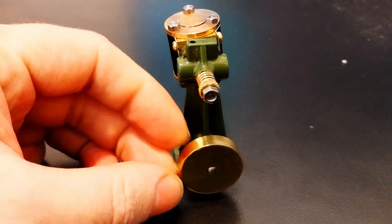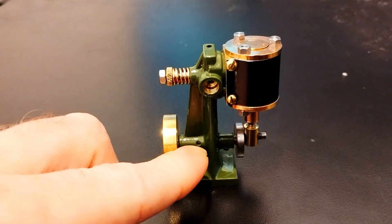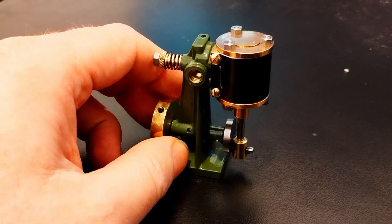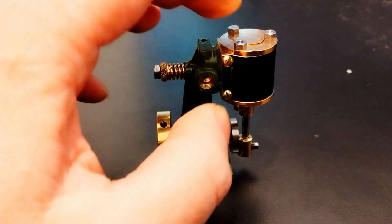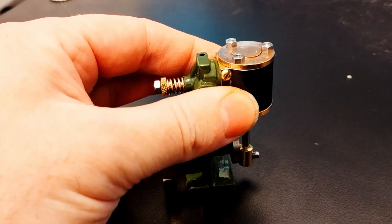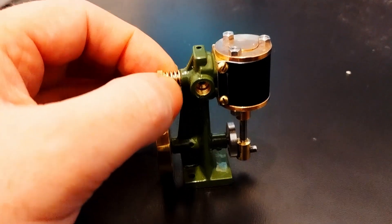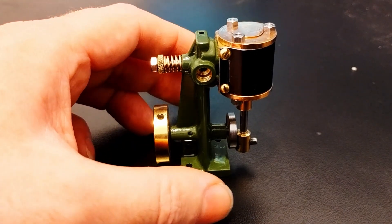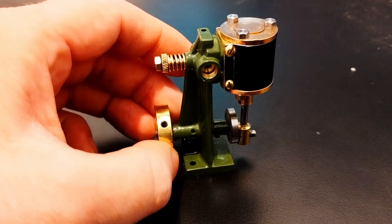The engine is now finished. I drilled the oil port here to enable the crankshaft to be oiled. This nut here I originally did up tight while the Loctite into the cylinder was curing to help ensure that the shaft was at 90 degrees to the cylinder. Now that it's set, I've loosened it off to a more reasonable pressure — you just need enough to hold the cylinder onto the face of the main body. I still need to make a base for it to mount to and make an adapter for the air, for the engine and for the compressor to join the two together, and then it'll be ready for testing.